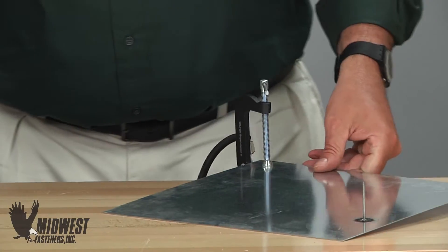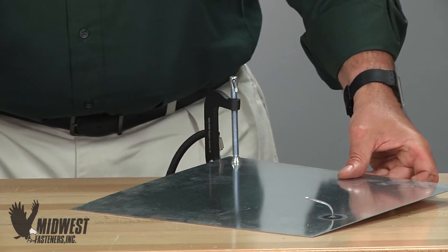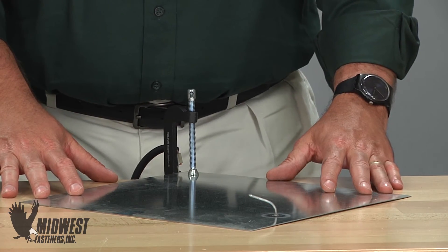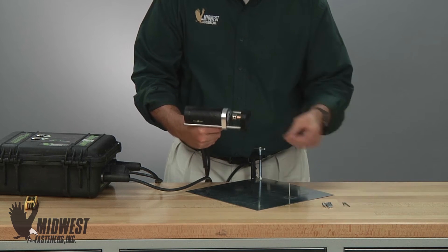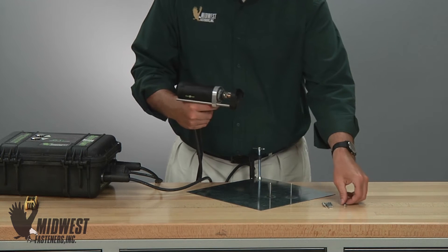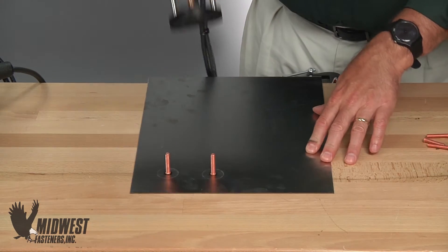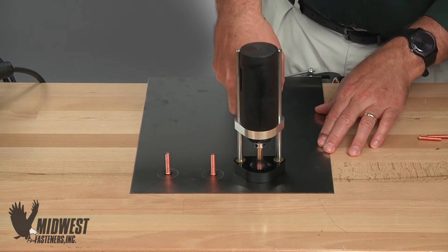The weld will provide good strength under pressure. The strength of the CD weld is strong enough to fail in the fastener before it fails in the weld when properly applied, ultimately giving superior strength for holding firmly in place on many types of applications. Since the CD process can deliver 15 to 20 welds per minute, material is installed quickly and positively. 110 volt systems can weld as quickly as you load, contact, and weld. Using the same type setup and steps, we can also apply stud-sized fasteners just as quickly and reliably.